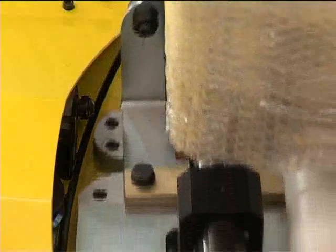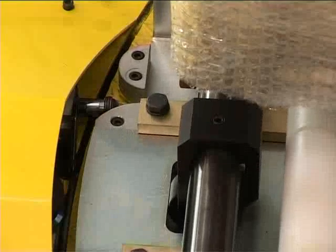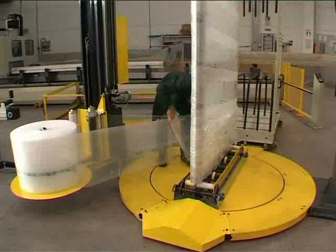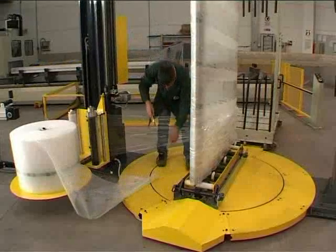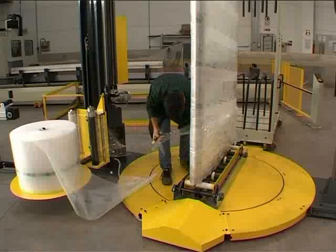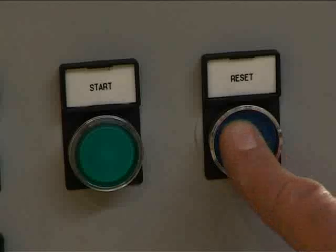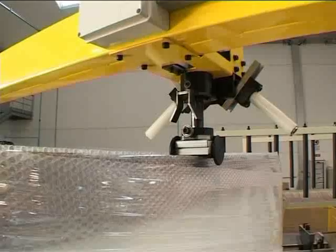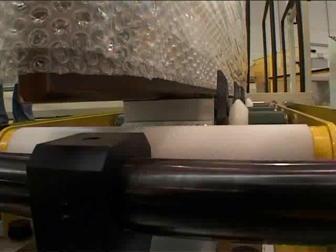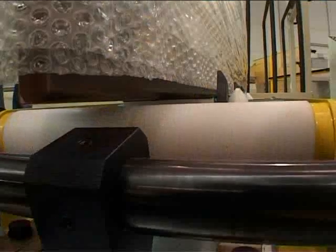End of the cycle, the turn plate stops in an unloading position. The vise switches off. Restarting the overturning preventer device and the roller conveyor lifts up, allowing an easy unload of the fitting.